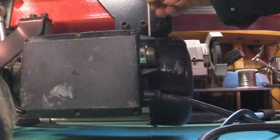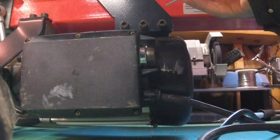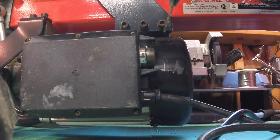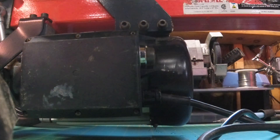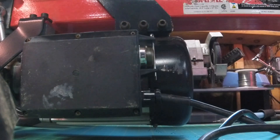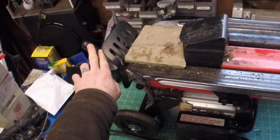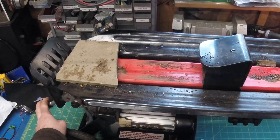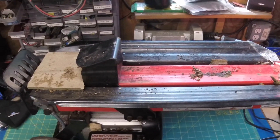What I'm going to do is drill a hole through this guard and that guard, and stick a cotter pin straight down. Hopefully it will hold the switch in permanently, and then we can turn the motor on and off with the foot pedal. I'd recommend a depth stop on your drill bit unless you've got pretty steady hands — otherwise you're going to go right through your switch and probably total your log splitter. Alright, let's see if it works. If I push down on the foot switch, the motor should come on. It feels good sticking it to lawyers who don't know what they're talking about.